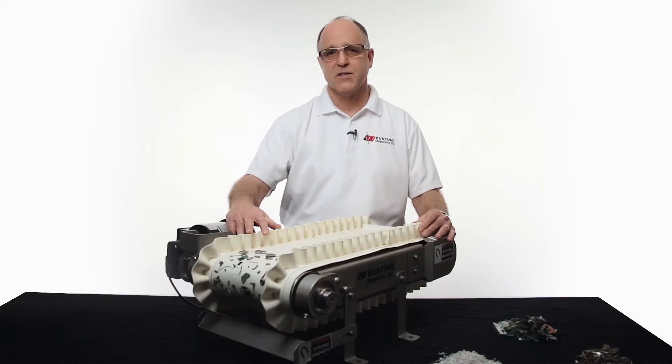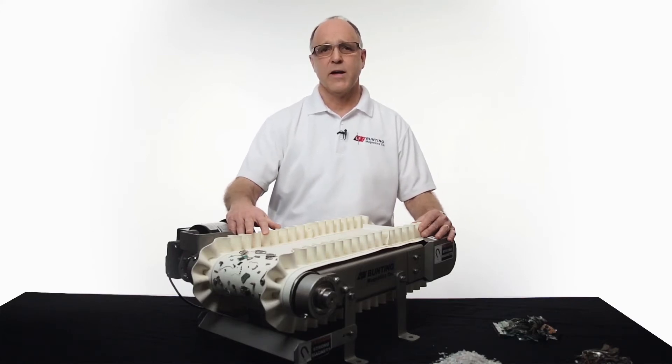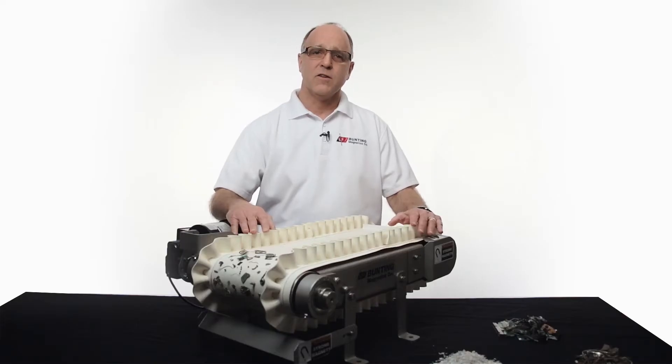This is used in the automotive, plastic, medical, and computer recycling industry to separate out some of those very difficult paramagnetic materials and 300 series stainless steel pieces that have been work hardened from shredded and ground plastics. Customers can now achieve some of the cleanest plastic flake material or other material in the industry. The design provides for relatively low field height on the pulley, but an extremely strong field to attract, hold, and extract some of the weakest magnetic material contaminants.